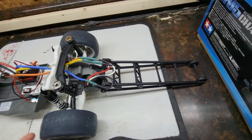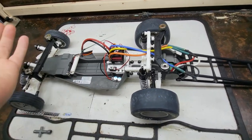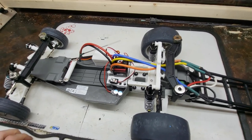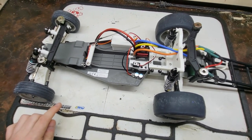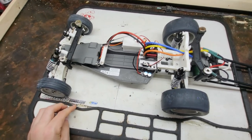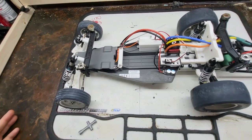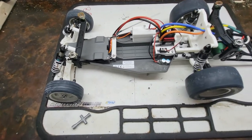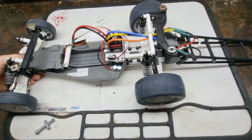One bad landing off the wheelie bars — I just grabbed a drag Slash wheelie bar off eBay, brand new in the package — if it came down off the wheelie bar too hard it's going to taco the chassis. I don't think 3D printing is right for things like that. For prototyping those parts in a more durable material, maybe. If you 3D print nylon, that might be a much better choice. But for PLA — your basic out-of-the-box printer filaments available on Amazon — I use Monoprice and I love it, it prints great, but it is not the strongest stuff in the world. Switching your materials will help, but honestly, molded plastic is going to be so much stronger for high-stress areas.